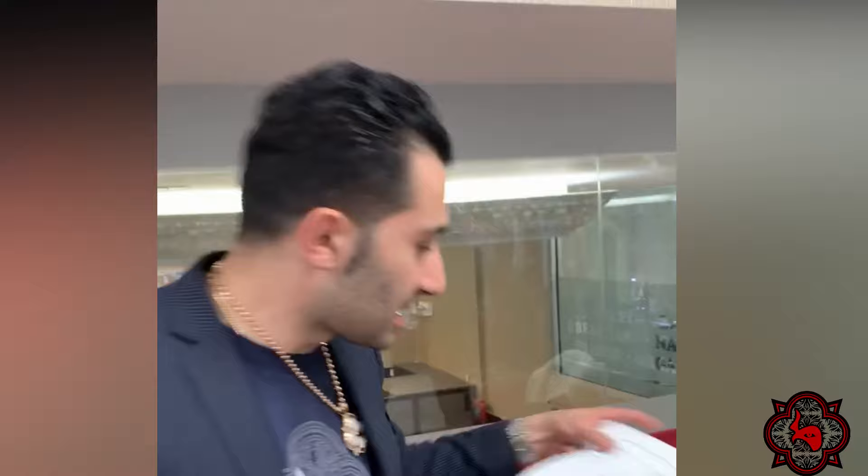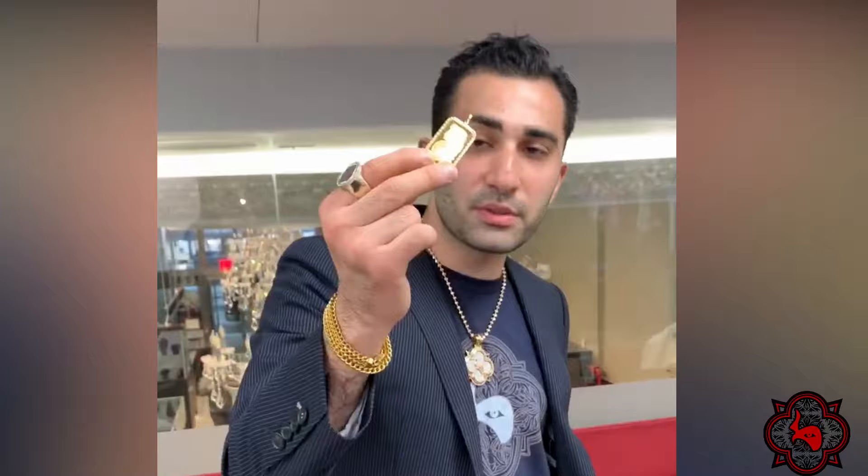This 14-karat gold frame also has copper and zinc as alloys, but not in the same percentages as the fake piece. The fake ring has 79.68% copper, while real 14-karat gold would have copper around 15–20% with 57% being pure gold. Also remember: wearing fake gold with lead in it is dangerous — once lead gets into your bloodstream it wreaks havoc and can cause mental impairment. Stay away from garbage metals.